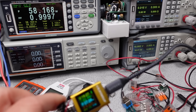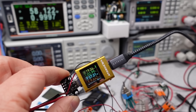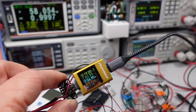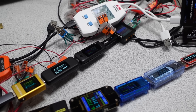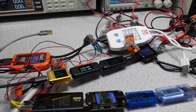These are cheap and simple meters, and they generally use a 1% tolerance resistor, and many don't have proper four-wire connections. The value of this resistance varies meter to meter, but from what I found, it looks like between 10 milliohms and 50 milliohms were used. This means the burden voltage across these devices is quite reasonable, and they won't actually dissipate a crazy amount of power, even at 5 amps. They do okay, and I'll show more of that later on.